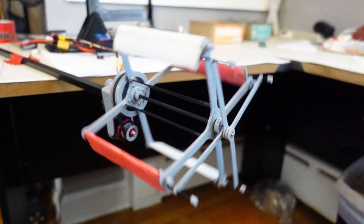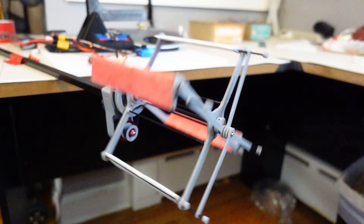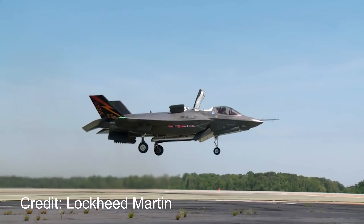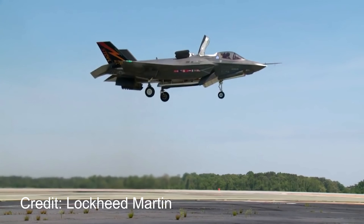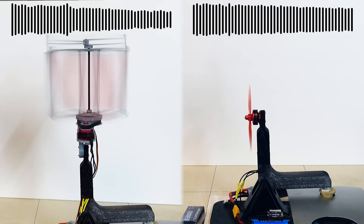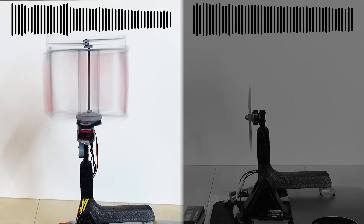Although the power loading and general efficiency is comparatively worse for my cyclorotor design, that doesn't mean it's entirely useless as a propulsion system. Jet engines are extremely inefficient compared to helicopter rotors for hovering, but at much higher cruising speeds, jet engines make much more sense for efficiency. The cyclorotor is simply another option in the design space that could be useful, and in some cases better, for certain applications. One area the cyclorotor beats the propeller is in rotor noise produced, which is far lower in volume and less annoying than a propeller. Just listen — I would much rather hear this fly overhead than this.